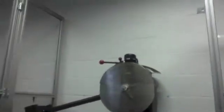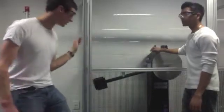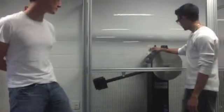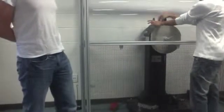When you hold the pendulum, you should hold like this, all the way from your thighs. What's going to happen now is he's releasing the lever, which is going to let the hammer fall, bring the potential energy into kinetic energy, which is going to impact the sample. That basically snapped in half. And it's done.